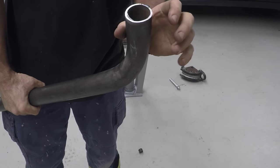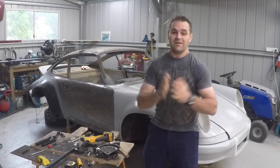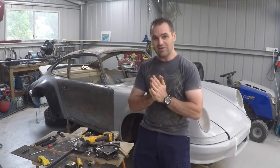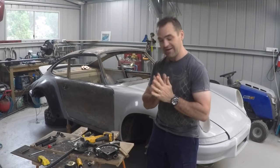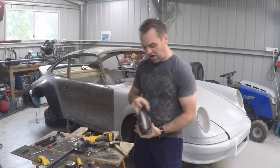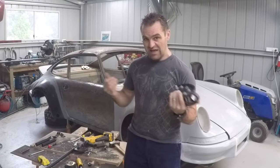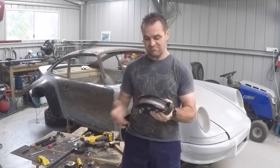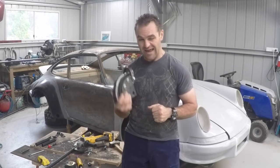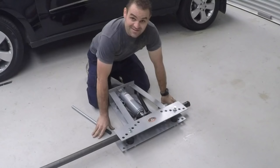That was terrible again — it's all kinked, it's not working. After hours and hours of frustration, I've had a night to sleep on it and I've come to the realization that the main issue is the die is just not a tight enough fit even after a lot of die grinding. My last option is to take all this stuff apart, go back to the original pipe bender, and try a sand-filled tube. This is the last shot.